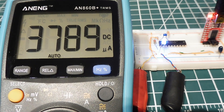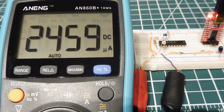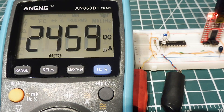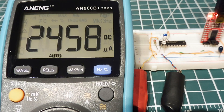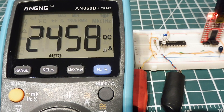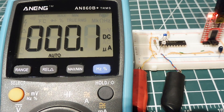If I turn off the LED, it drops down to 2.459 milliamps — that's how much the microcontroller itself is drawing running a small program. Now I'll send a command to put it into low power mode 4 — sleep mode — and it goes to sleep drawing only 0.1 microamps.